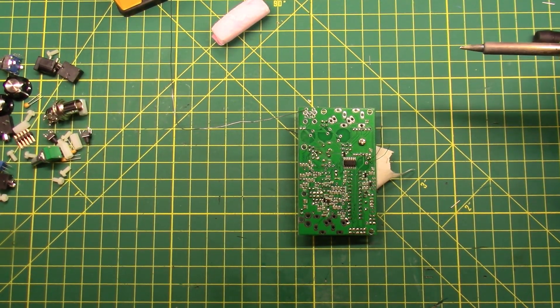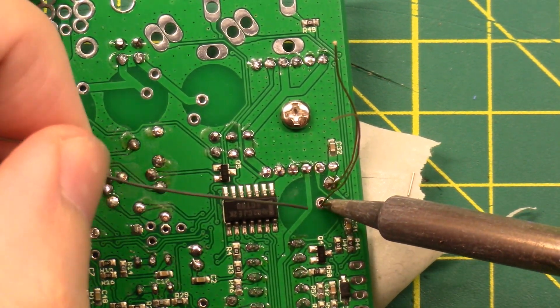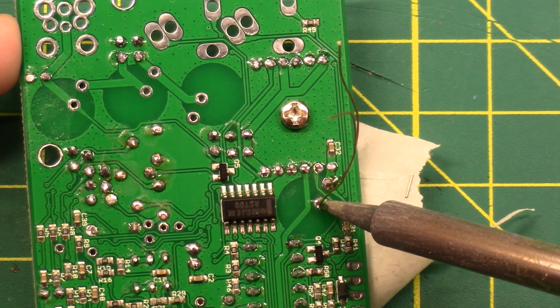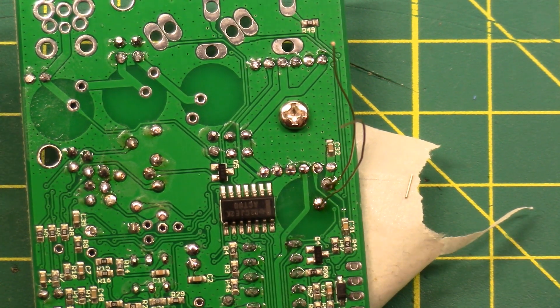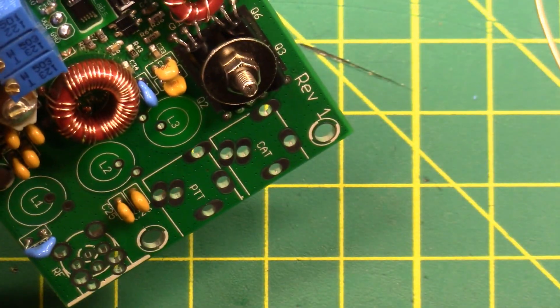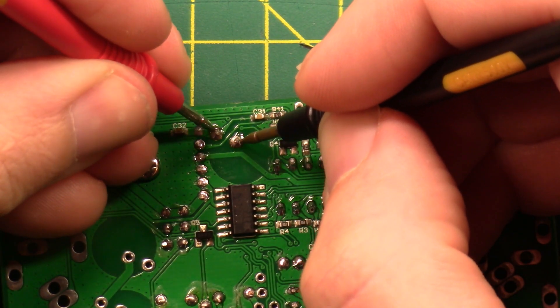Let's see if we can zoom in on this for the next round — and watch, all you'll get is a picture of the back of my head. I'm going to put my soldering iron down on the part, get some solder in there, and count out ten seconds: one, two, three, four, five, six, seven, eight, nine, ten. And there it goes. Flush cutters to cut, tape off, meter out — and it works. Awesome.